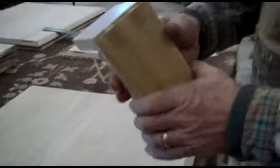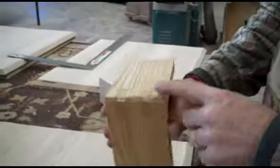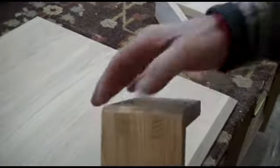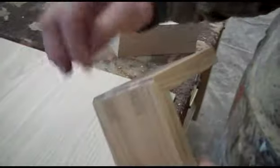But then we're going to use what's called a dovetail spline — a spline that goes into a dovetail slot. You drive it in and it really makes that joint extremely tough. And then it has a little quirk — it's a quirk miter, so it doesn't come to a point, because that's too easily damaged. So I'll just make these two little radiuses come together.